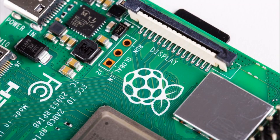And you'll see this on electronics. For example, here's a close-up of the Raspberry Pi 4. If you look at the bottom right corner, there's this metal tin that's soldered onto the Raspberry Pi, and that's over the Wi-Fi and Bluetooth circuitry. And you can sort of see the antenna to the northeast of it. This shielding reduces electromagnetic interference. It makes it easier to embed the Raspberry Pi in products because the emitting section is shielded, and it also probably improves the Wi-Fi and Bluetooth because you don't have it getting interference from outside RF noise.